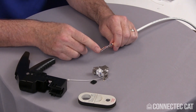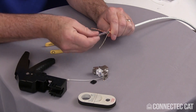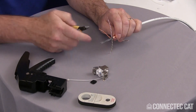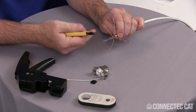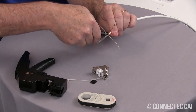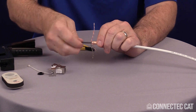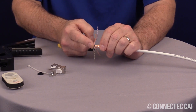Next I need to remove the separator before I start putting the connector on. I'm going to pull all my pairs off to the side without untwisting them, then bend them back. I want to cut this separator — I call these individual legs here flutes, after machining. I'm going to use the flush side of the diagonal cutters and cut as close as I can, at a nice 45-degree angle downward. Do all four legs, then spin it right off. You don't want anything protruding past here, otherwise your connector might not seat correctly.